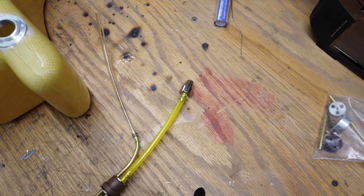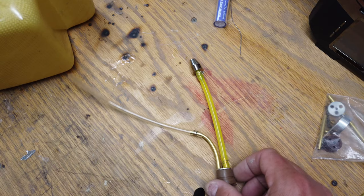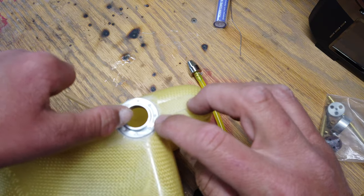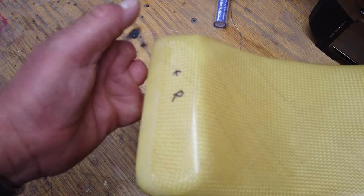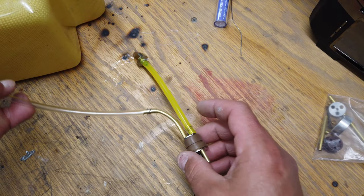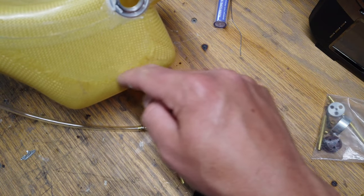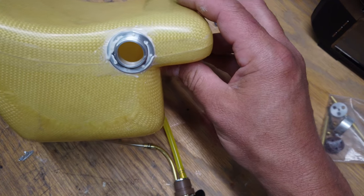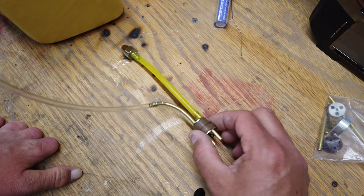This is what I've come up with for the saddle tank line setup. We've got our vent line going in on the left — that bend flows nicely to the back corner of the tank — and then we've got our main clunk line. I'm not too worried about the saddle tanks; they're a weird shape so getting a clunk that moves to all corners isn't really possible. But because these are feeding the main tank, we just want a good reliable fuel source.